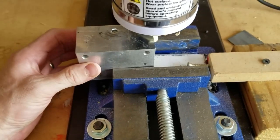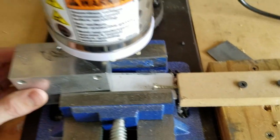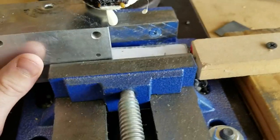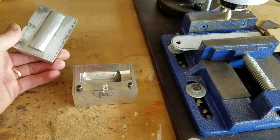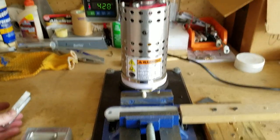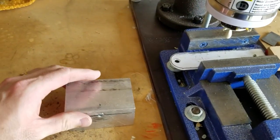When I lined it up one time, I locked it into place and pushed the wood with the screw up against it until it stops — and that's your mold stop. So from now on, when I push in my mold, I push it all the way to that screw and I know that the sprue hole is lined up. And I have about 2,000 shots of this mold in this machine with this particular setup. It works and I really like it.